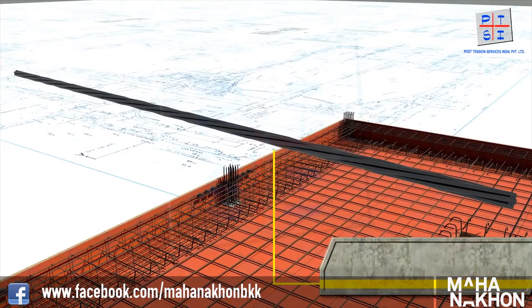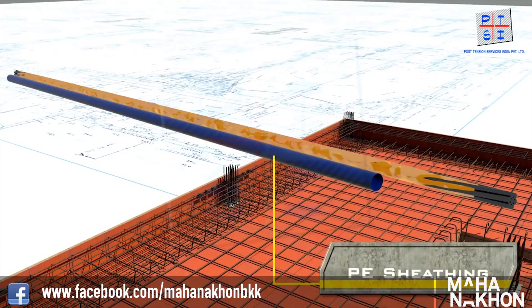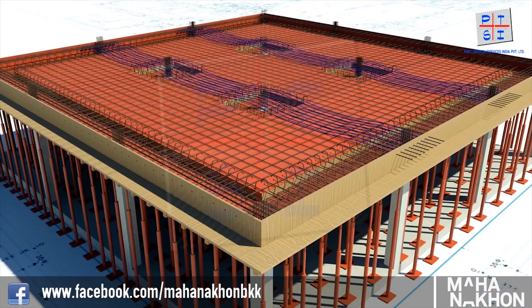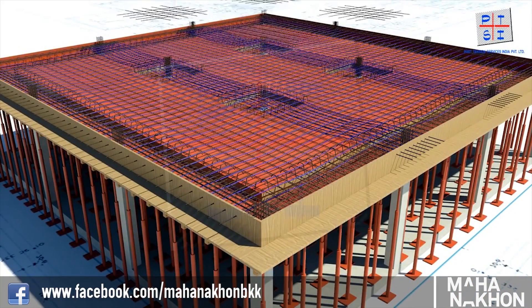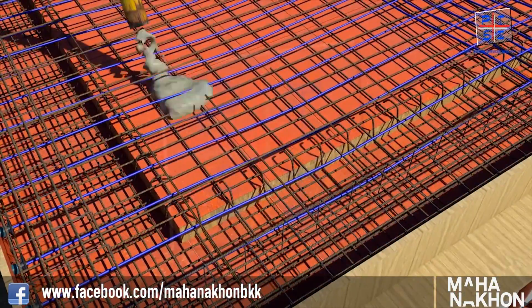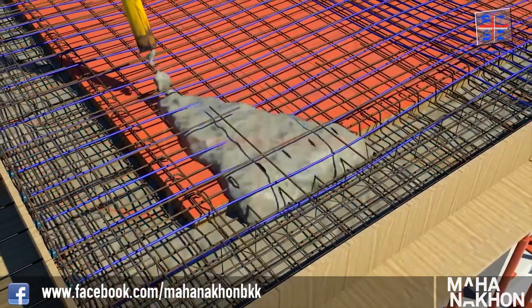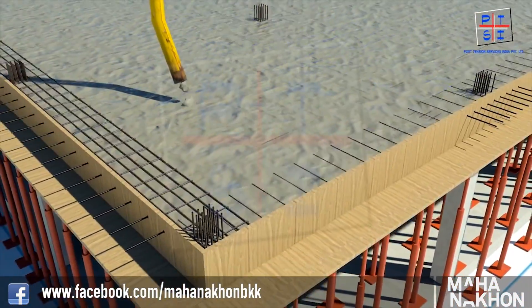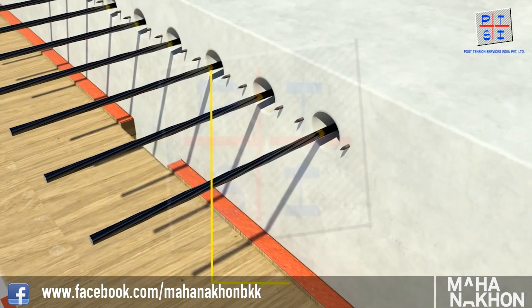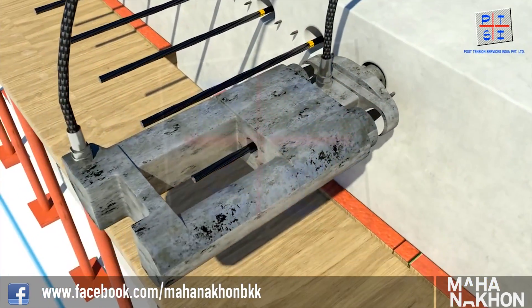Very interesting question — I have to admit I had no idea what post tension was, so I went and asked some experts and this is what I learned. Post tension is a construction technique which can handle long continual spans like a bridge. It uses traditional reinforced concrete but inlays high tensile steel cables. The cables are laid prior to pouring the concrete, then tensioned with hydraulics as the concrete cures. This enables us to cantilever sections and run long spans between columns.